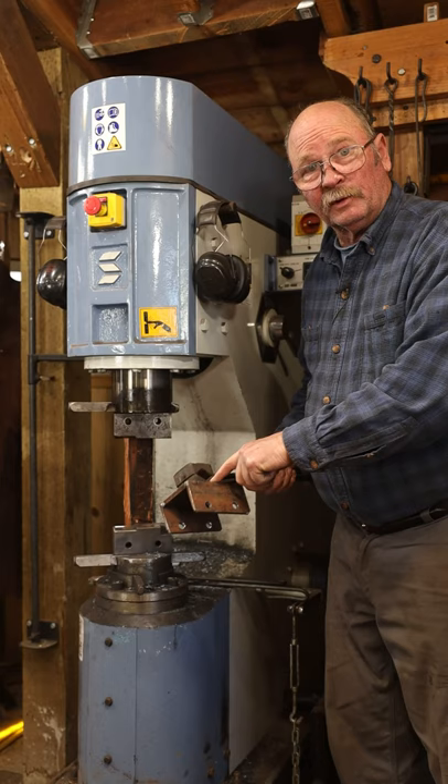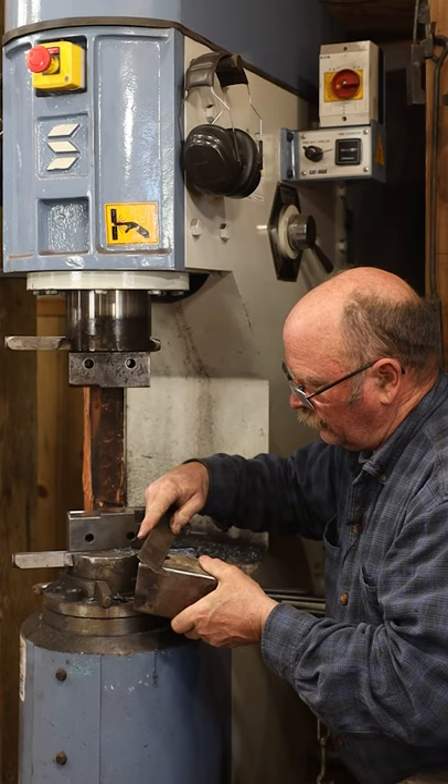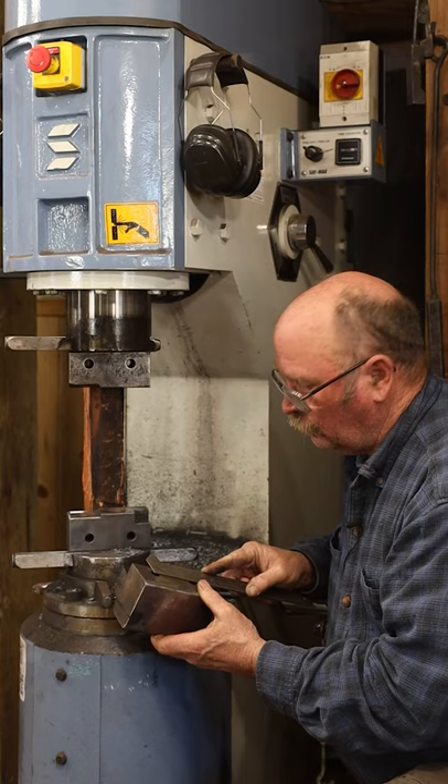But not once it's been welded to these plates. I think all of the SAMAC dies come with these holes now, though I'm not absolutely sure. They're a half inch in diameter, and it looks like it's perhaps an inch and nine sixteenths from the top of the die, and they are two and three quarters inches apart.